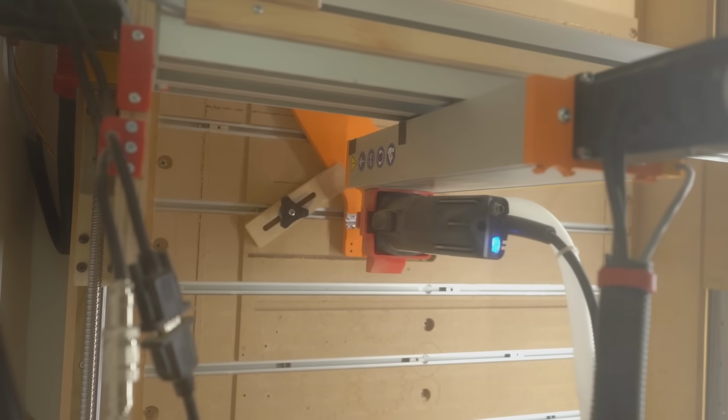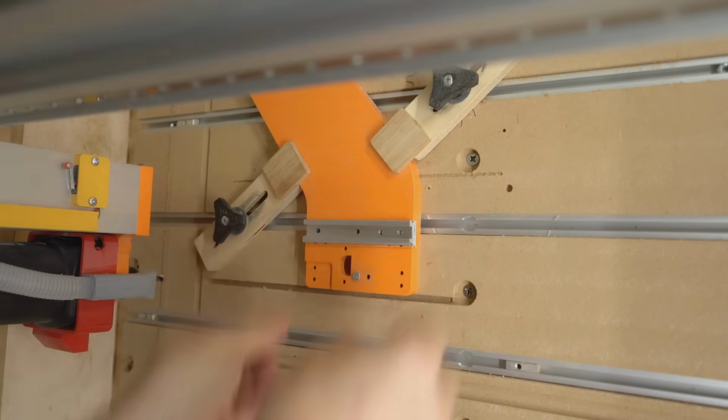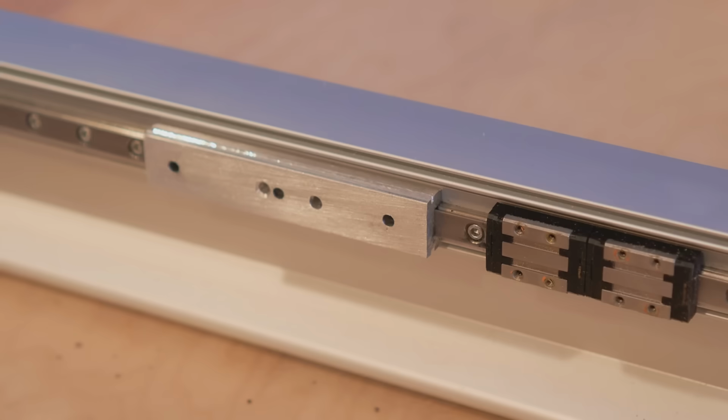with my very well machined bearings in that machine, where I just cut a groove in aluminum blocks that fit over the hardened steel linear guide rails, because I didn't have any bearing blocks for that. If you watch that build, you'll know what I'm talking about. That was another little controversial thing, although very few people watched that video, so I didn't get a lot of feedback on that. Anyway, so there's a little bit of side-to-side deflection in that gantry assembly because of the height of the sides of the gantry.